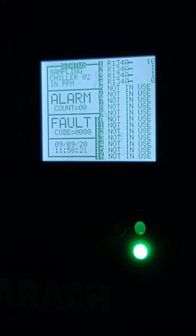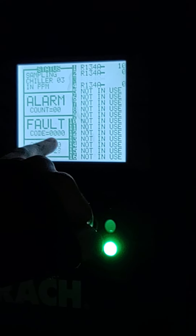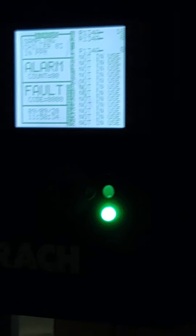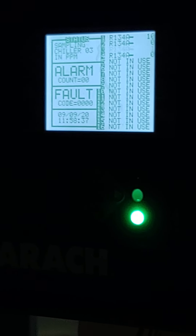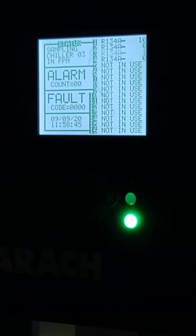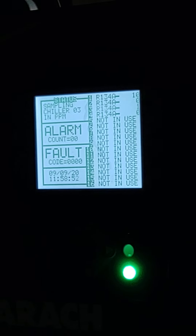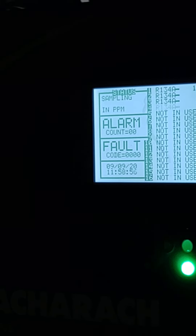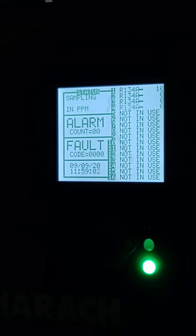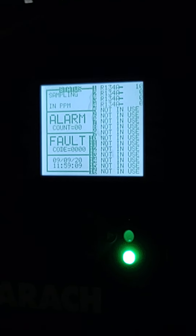What's the fault code up there? There is no fault. It'll count the alarms here, and there's like a library of fault codes. So you disabled the bells so we don't have to sit here and listen to them. I think Lyle has the relays pulled off. This goes to the fan and the enable relay. So it goes to the enable relay of the chiller itself — it doesn't go into the BMS. It's not connected to the BMS. So you could actually have one chiller go off and the rest of them are running. It should cut off all three. The way the schematic looks, we're landed on one relay, and that will fire all three.